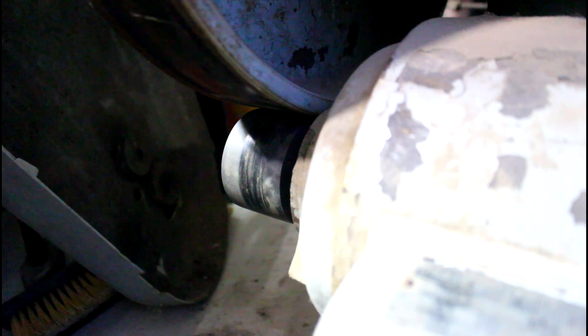Here you're looking at the motor pulley. As soon as I turn this on, hopefully people will tell me exactly what's wrong. The motor is my big obstacle right now — I can get everything else working but the motor is a little bit of a mystery. So I'll try it — it's not getting enough power. I'll spin it by hand to help it start — and there it's running. I'm assuming that's high speed but it's running at about a quarter of its expected speed. I'll shut it off. There's slow speed.